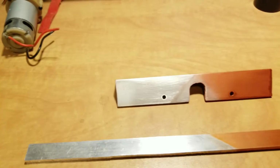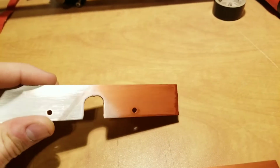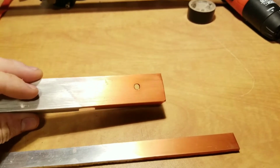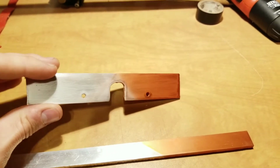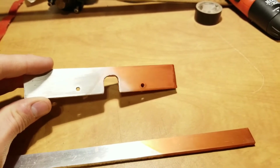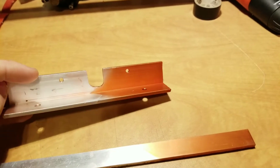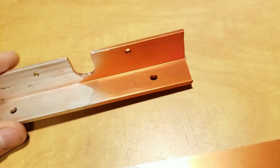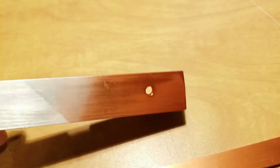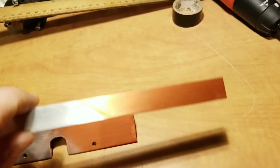All right, so we're here in my office, and I've got two sample pieces here that I've been testing with. This was one that I did earlier on, and both of these were anodized for about 2 hours, and then they were dyed for about 15 minutes at 60 degrees Celsius. And as you can see, the color came out really nicely. I understand I could probably get a better color if I used proper anodizing dyes, but I wanted to try this Tintex fabric dye because it's cheap and easily available here in Canada. You can get it pretty much anywhere. And the finish on this turned out really nice. I didn't do much to prepare these pieces. They're just bits out of my scrap bin. Very nice, smooth finish.